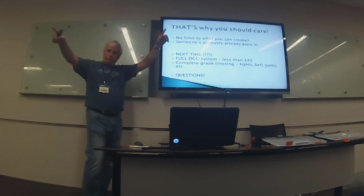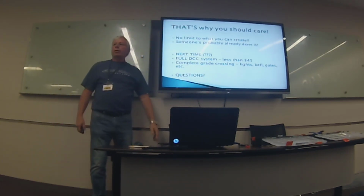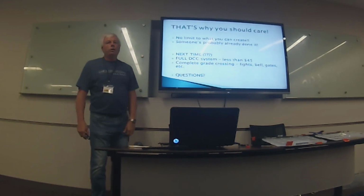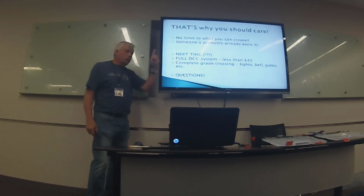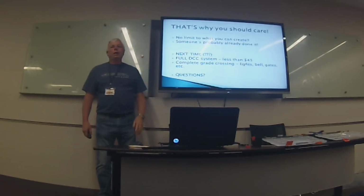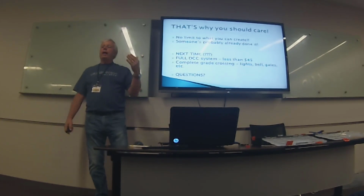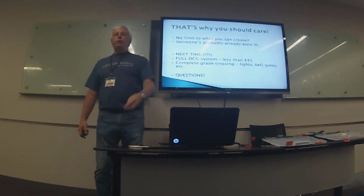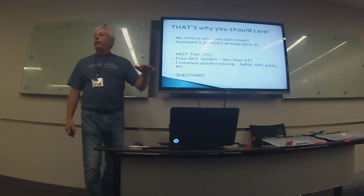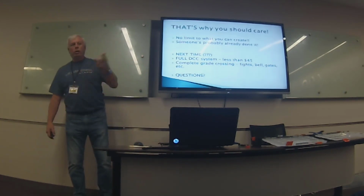Now, if there is a next time, if I do an Arduino Why Should I Care Part 2, two things I'm going to bring here live and show you. You can have a full DCC system for less than 45 bucks. All right? It would be a good thing to use like for a programming track because it uses JMRI. The $45 does not include your computer. Your computer has to be hooked up because you use Panel Pro, if you're familiar with JMRI, use the Panel Pro side of it to actually pull up the throttle to run the train. Use Decoder Pro to program your engines. We use it all the time at the K&I.